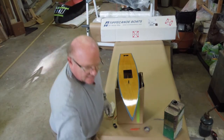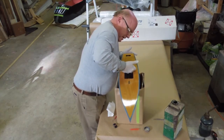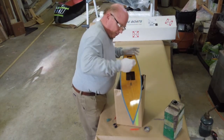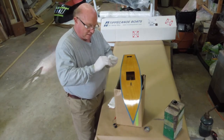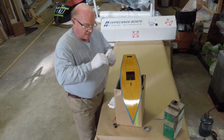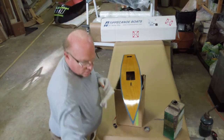That's the first step. Second step, taking some Scotch-Brite and cleaning the area there. All right, we're going to wipe it down again. Okay, so we know that this surface should be very bondable. Same thing here. I'm going to hit it with a Scotch-Brite. And this is only marginally going to increase our bondability. It does give us some more surface area, but this is not truly how it's going to be bonded. Now let me get to a clean piece of the paper towel. Clean it off again. Okay. So this is now done.